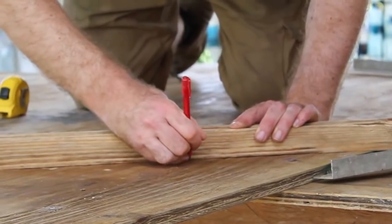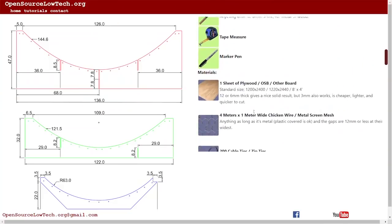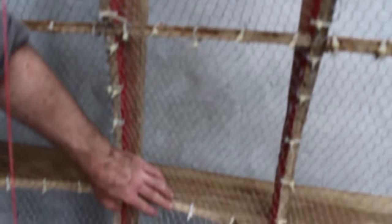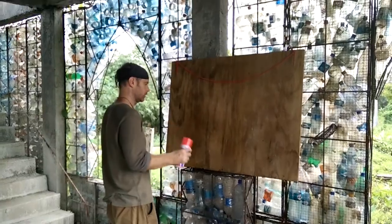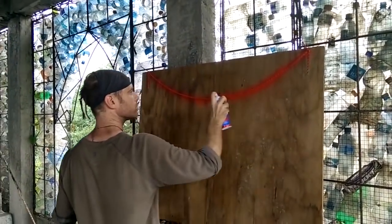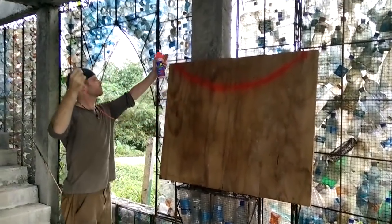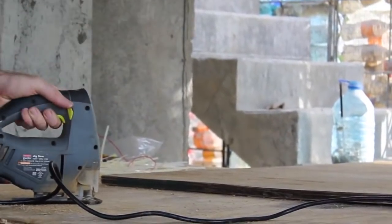Making these slats is super easy — just mark out the box. There's a full tutorial on the website, linked in the description. To get the parabolic curve, you just hang a light chain of a fixed length between two points and it hangs in a catenary curve, which at this kind of scale is very similar to a parabola. Then you spray paint over the chain and jigsaw out the shadow it leaves, and that's pretty much it.